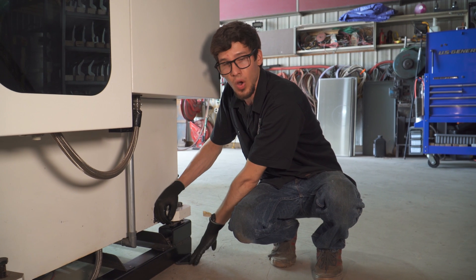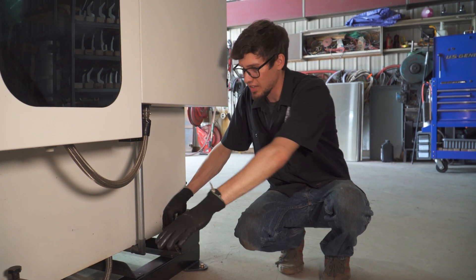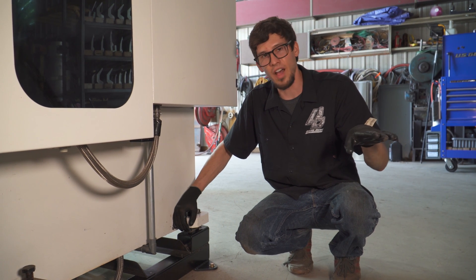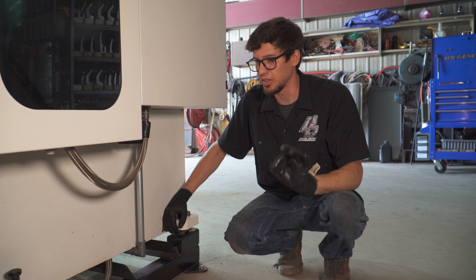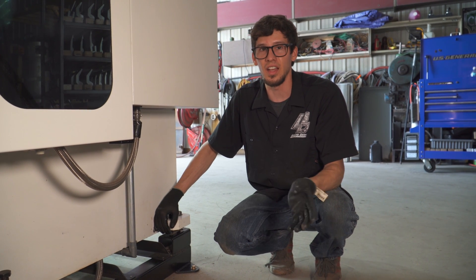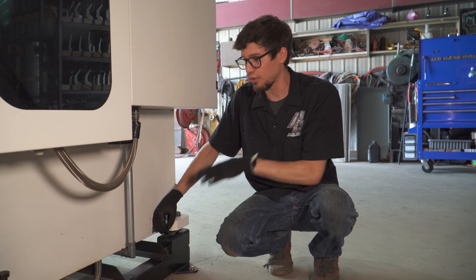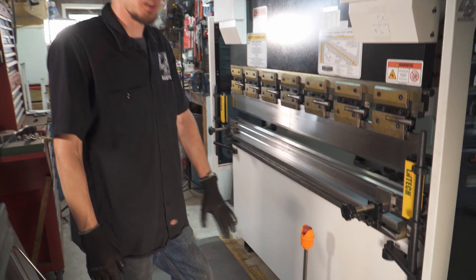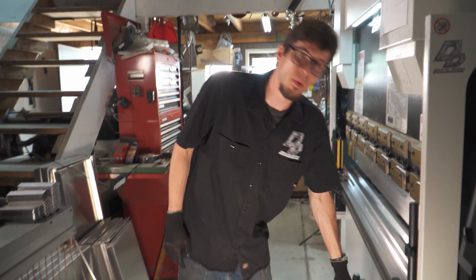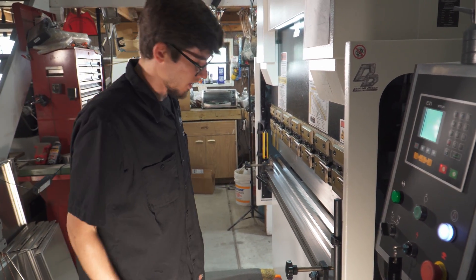You should always anchor these machines to the floor with concrete inserts. It's got leveling pads with bolts so you can get it level on every plane. If you just set these on the floor you're going to have inconsistencies in your bends — as heavy as these things are, they will flex around. So it's really important to get it sucked down to the floor, leveled and set up right from the start. The machine comes with a two-stage pedal with up and down functions, plus an emergency stop button on top.